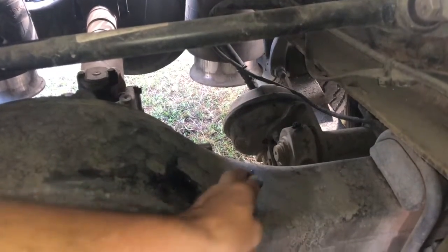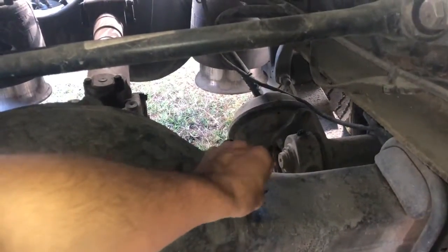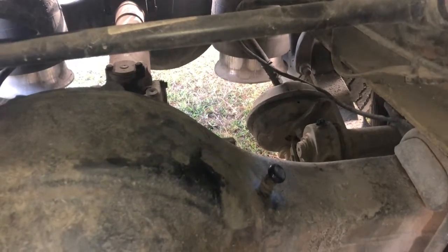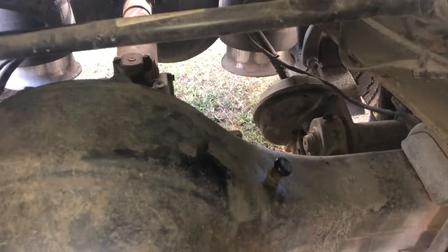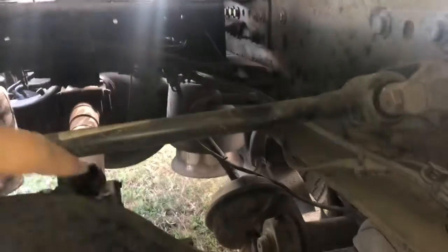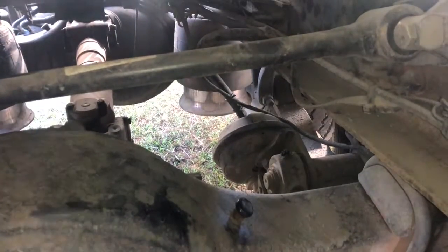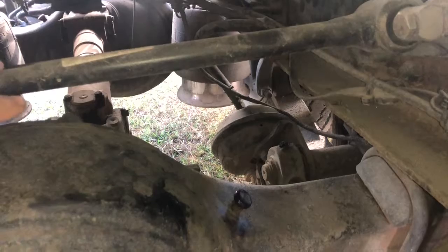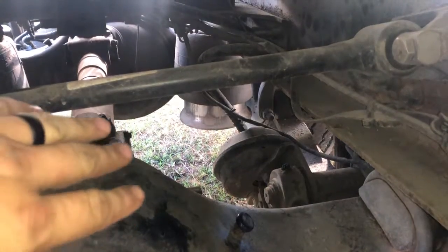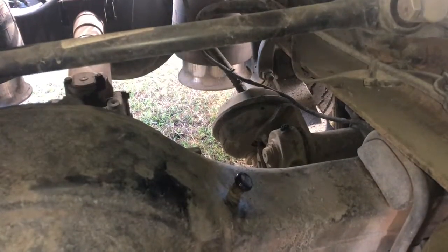Don't let it sit there and build up with dirt and grease. You might have to come out here and while you're waiting to get loaded or whatever, just spin it around. That's what I do — every morning when I leave I do my pre-trip. I get up here on the catwalk and I free that one up and I free this one up, because I don't want any more wheel seals busting on me. It's just one of those small details that you don't really see explained on YouTube.